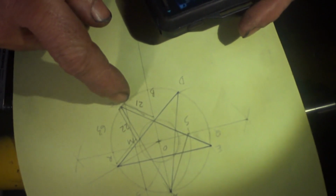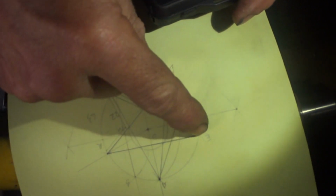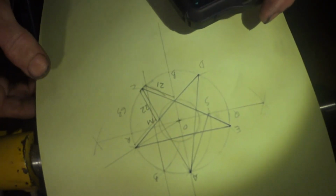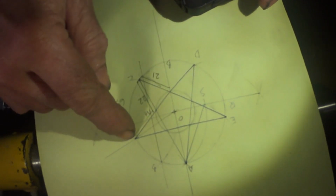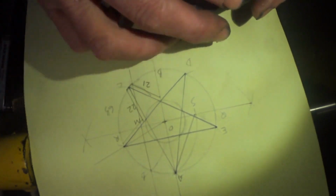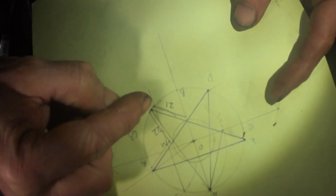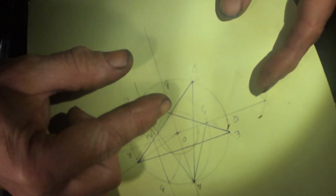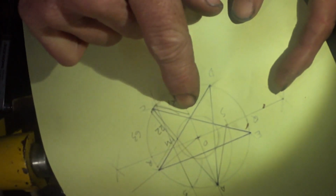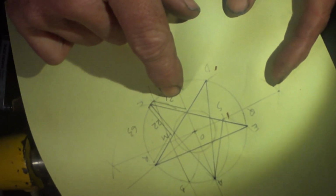63mm diameter circle, and looked up online how to inscribe a pentagram into that circle, because that's what's going to form on the face of this, which is there. Okay, and then we're allowing a little border around each of those points of the stars of 2mm either side, and that gives us a length of cutting in till they'll meet of 21mm.